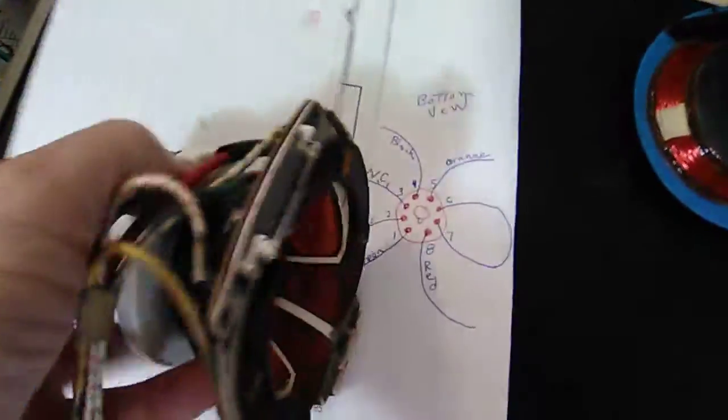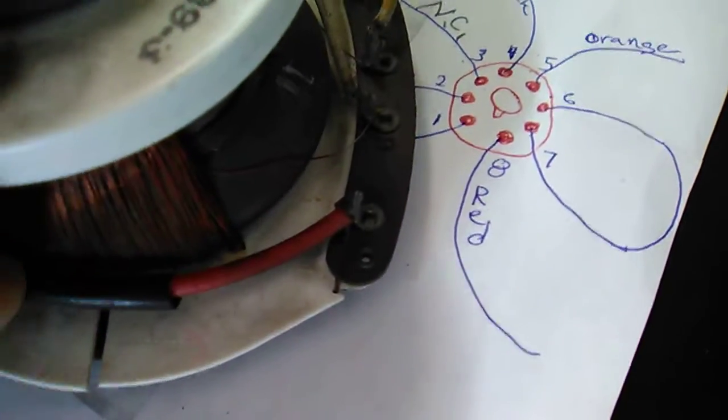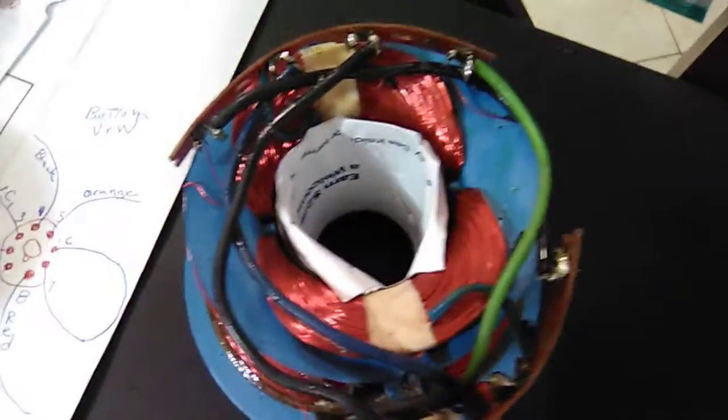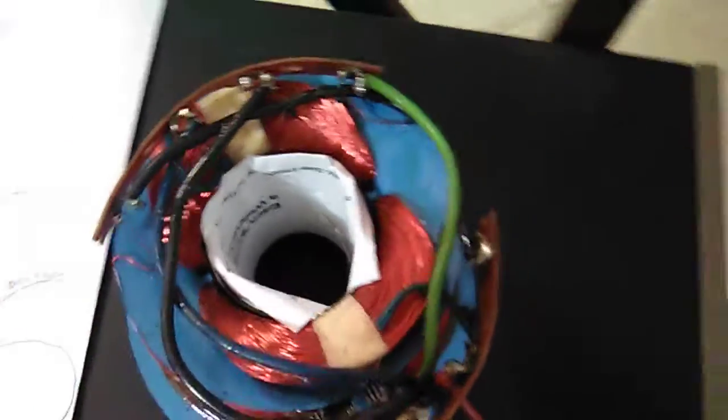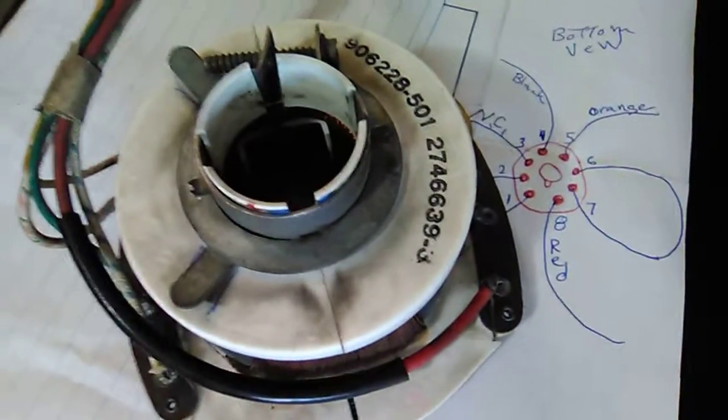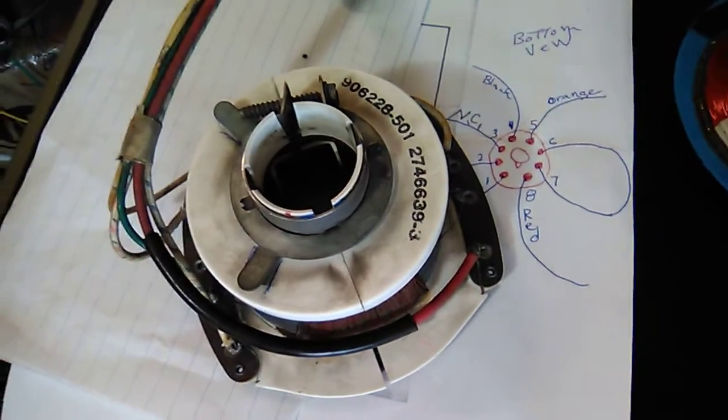So my next step is with the original flyback or deflection coils. I'm going to take a rubber mallet and smack these things and see if I increase the ohms, or maybe they won't increase. It'd be so little I won't see it. But I have to do the one with the red. So I gotta take this somehow and mount this, and I'm just gonna keep this for a step in for testing. Because all I need to do is read the boost voltage, because with this one on, my boost voltage was lesser than my B plus voltage. It was less by, I don't remember how much, so as long as I can remember stuff like that.